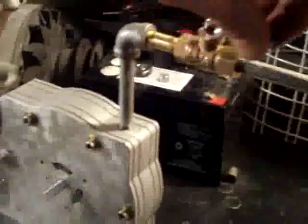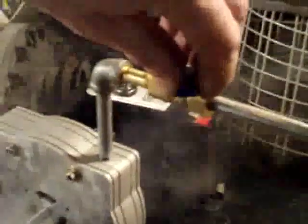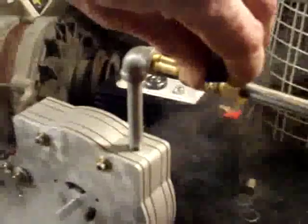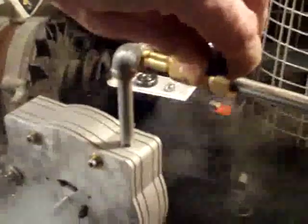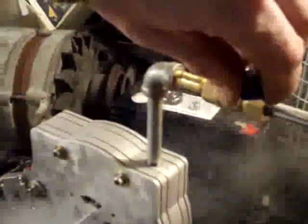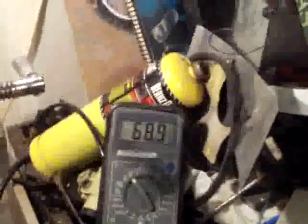3, 2, 1. I'm trying to adjust the steam input here and be more efficient with my steam — get it up to speed, then increase the steam a little bit, so I hear the speed rise up again as the pressure's dropping to 45. We're getting 81 volts right now, 75, 72.